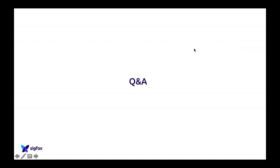Yeah, I can say definitely. Thanks, it's a really good question. The device that you saw, the Sensit, is actually multi-zone. It works in the US, in Europe, and I think in different zones, and there is a software switch to change the zone. Why I said it was complex is that today you don't have modules which implement these different radio zones. So you have to take a solution like a TI transceiver and implement things yourself. The Sensit is a perfect example. We could only choose the TI chipset to do that. So this is the first thing: the Sigfox module is a problem for now.